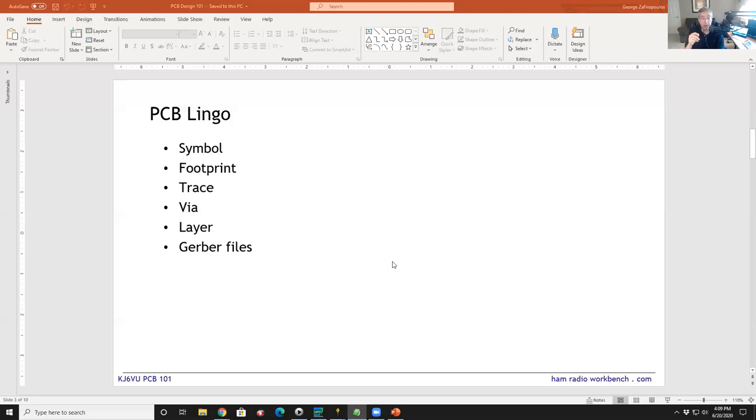So when you look at a board and it says U1 is a 7805, that ink that's printed there, that's the silk screen, just like on a t-shirt. It just means it's the printing. It means nothing electrically. It's just whatever you cosmetically put on the board so you know what the connector is or, you know, your name or whatever goes on there.